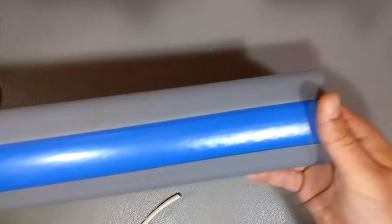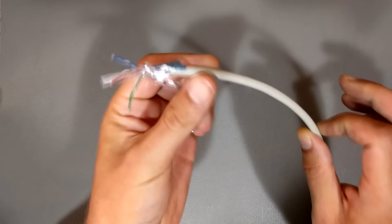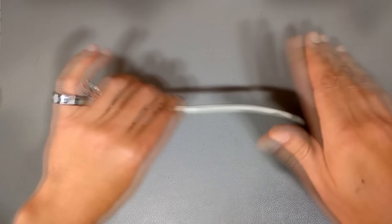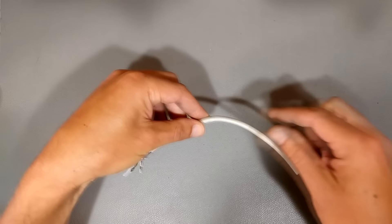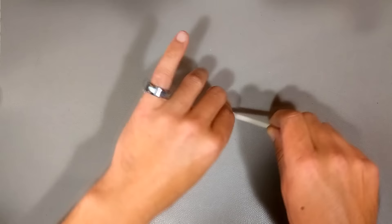So you don't want to drive over an Ethernet cable with, say, a desk chair — and that's why these cable guards are quite nice. The second thing is when you're routing any Ethernet cable, you have to be very careful. You should never, ever crimp it sharply. That's very bad — you've squished everything inside, you may have problems with speed, and eventually you'll break the copper wires and it's going to stop working. So whenever you have to change directions, you want to gently curve it — a one-inch or two-inch radius. You never want to crimp it and stuff it in a corner.